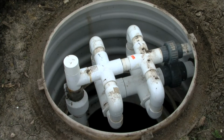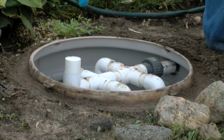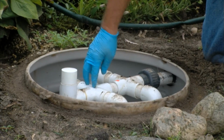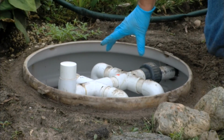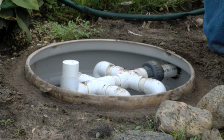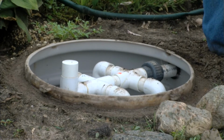In this particular case, we've got pipes going into side walls. We're not going to be able to move it much. So in an instance where you're installing a system, you make sure that this device is level. And you do that by putting a level on it, quite simply. The way it splits is the water comes in from here, goes out these 4 crosses both ways. That's 4 splits, and then the final one goes out this way to the discharge, so that's 5. So 80% of it goes back, it's collected and goes back to the septic tank, 20% goes to discharge.